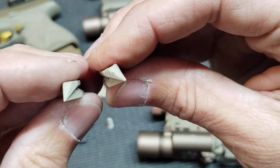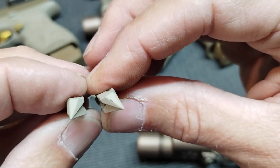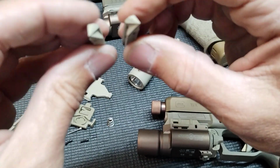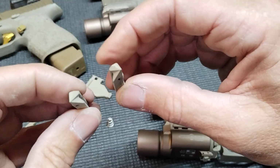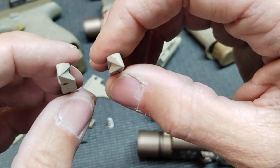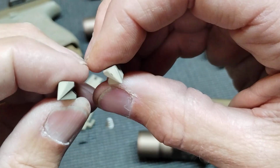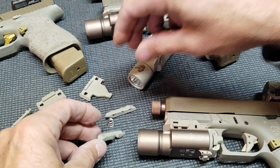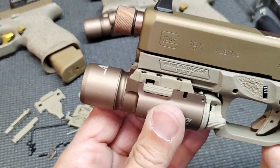It's not 100% because the screws are still wanting to pull straight down, but it will give it a little bit of a, I hate to use the word kink, but that's kind of what it'll do. It'll give a little bit of a kink that may be just enough to tighten it up on your rails. You can go a little further if you wanted to, but usually just a little bit on the ones I've done, sanding it down at that angle. Hold it in while you tighten them up, and then it tightens up the whole system. So anyway, there it was, less than a half hour.